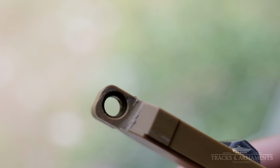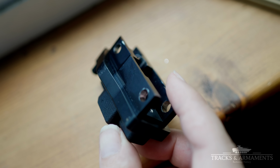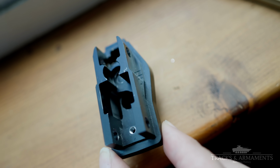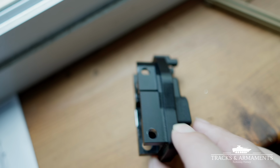This is evident when one disassembles the firearm as well, as the hammer falls forward once the carrier is pulled out. It seemed evident there had been a lot of hand fitting on our gun. It was clear the tray for the hammer pack had been hand filed, and it appears the holes for the retaining pins had been reamed, and machine work had been performed for the bolt clearance on the back plate after the parts had been painted.